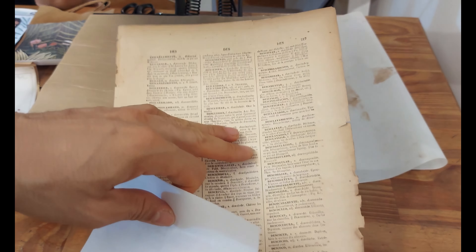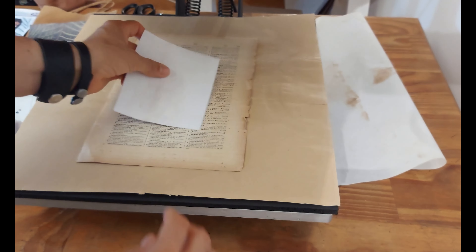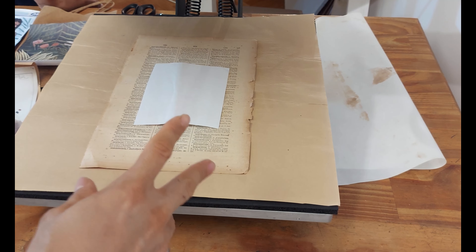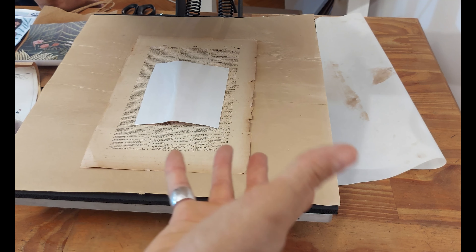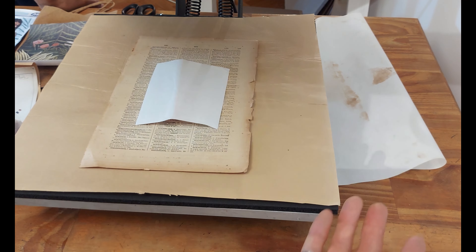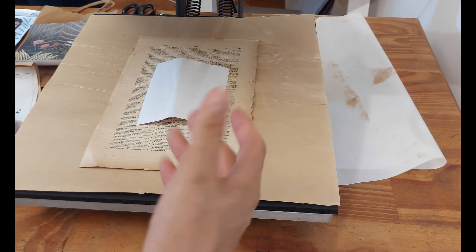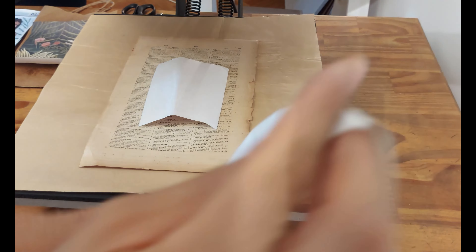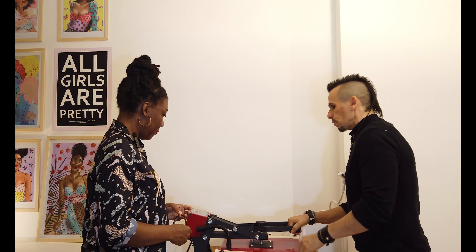So this is the first test. This paper has no coating, has nothing. It's going to go like this. And this is the design that we're doing on it. The time — it's not like a regular sublimation, it's more than that. It's going to be 200 Celsius, or 395 Fahrenheit, for 90 seconds. You can try your own paper and your own times because they are different. We've done a paper for 140 seconds and it worked, but the line starts to change. So we don't like it — the design is not sharp. We're going to do it for 90 seconds and you'll see the results.